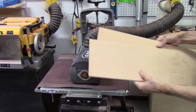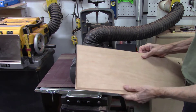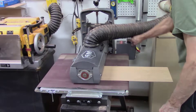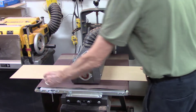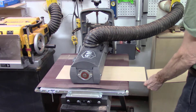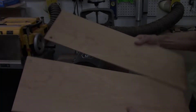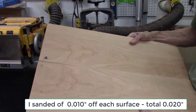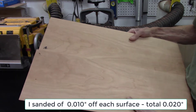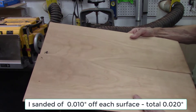I had these two cherry boards measuring about 123 thousandths coming off the bandsaw. The panels were sanded as shown previously, sanding off two to three thousandths off each surface with each pass to the board sander. Those two boards measured between 103 and 105 thousandths after sanding — so again we took off about 20 thousandths to get the saw marks out. All they need now is a little bit of hand sanding and they're perfectly smooth.